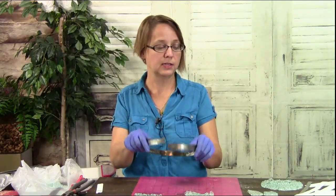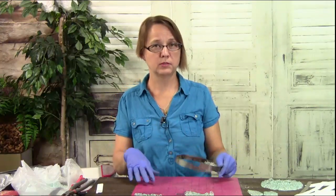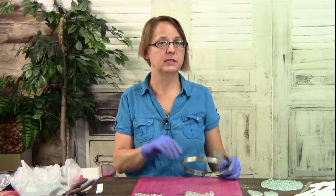Now, the firing schedule is, of course, for window and bottle glass. If you're using art glass, you want to use your manufacturer's recommended tack schedule.